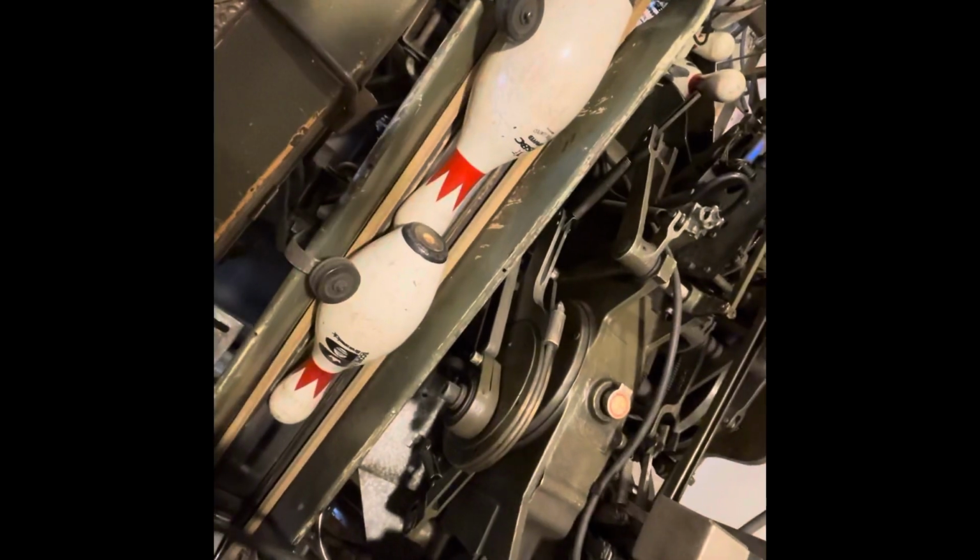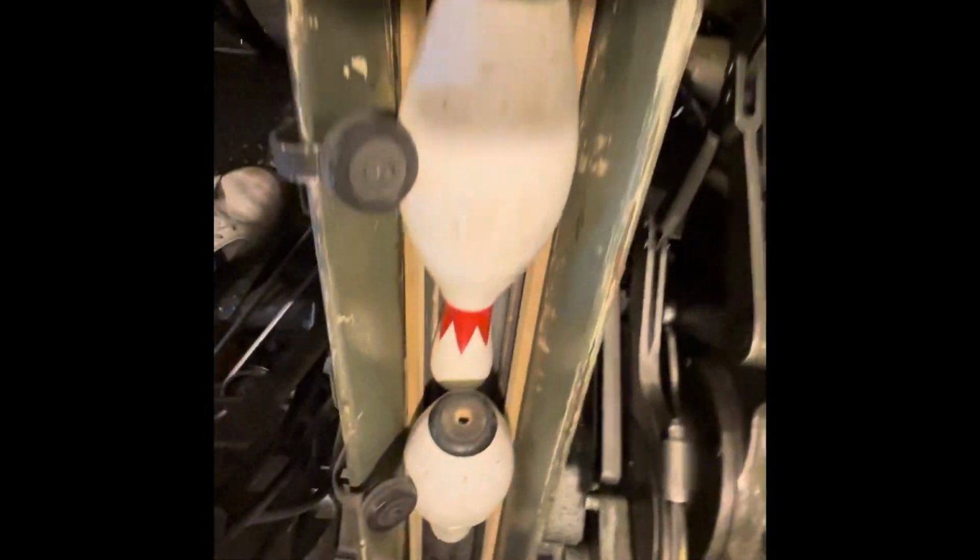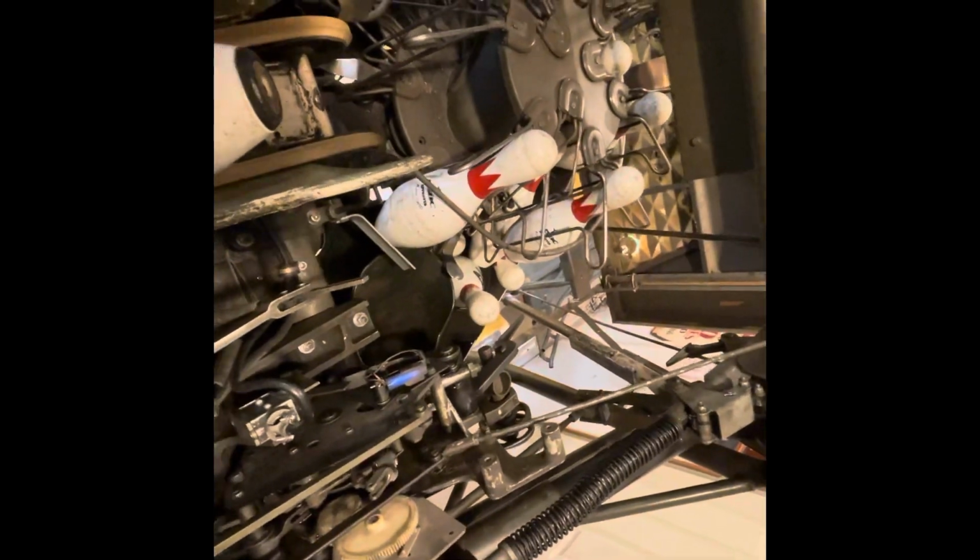Now in this situation we had the pin gate locked again, which is stop feeding pins, because it looks like we got a deck jam over here. We got a bunch of pins that are where they're not supposed to be, and it's stopping the turret from indexing to the next position. See, it's in between right now, so until that clears, that pin gate's going to lock up, which lifts the two rollers, which stops the pinwheel. So we need to clear out those pins right there so we can get the machine running again.